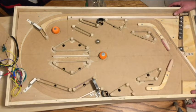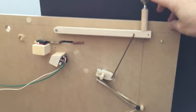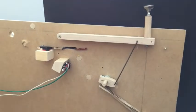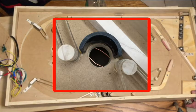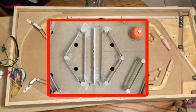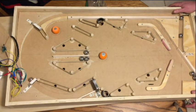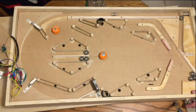Those are mechanical flippers of my own design. I've got a couple of holes in there that will also trigger a light — if you get a ball in each of the right and left holes, you get a light, just to see if the ball running through the copper wires would reliably connect the circuit. That top triangle shape in the middle is my main scoring idea — one side might be a thousand points, either side might be 200 points.